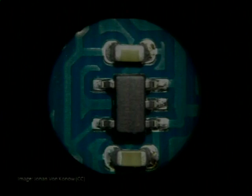Chips, you can get your tweezers right up under there, make sure you're plucking the right part. You can find a bad solder joint, you can inspect stuff that you worked on, and you can get down to some very, very tiny parts. I think that's an 0603 and a, that's not a SOT-23, it's another, it's a 5-pin package. It's an op amp or something, but you can really get in there easily and pluck stuff out. It's like you're working with big Lego blocks instead of tiny, tiny subgrain of rice parts.